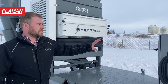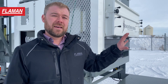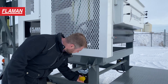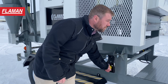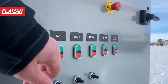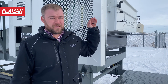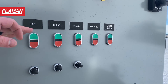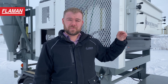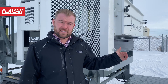This cleaner has a complete electrical panel exactly like the Bench full-size cleaner. I really like this panel because it has variable frequency drives incorporated in it, which gives us the versatility to speed up and slow down different parts of the cleaner. It is pre-wired with different clean grain auger and discharge auger electrical ports. On this electrical panel we have the fan switch to turn the fan and the cleaner on, and we can speed that up and slow it down with the variable frequency drive. We have the clean grain auger where we can speed that up and slow it down. We have the machine which you cannot speed up or slow down with the frequency drive — it runs at the same speed — but we can turn it on and off from the panel. There's also a cross auger which pulls our screenings to the side, which I'll show you in the back.